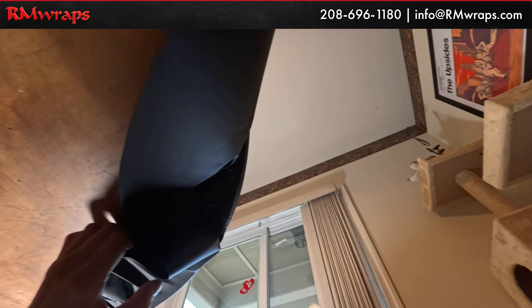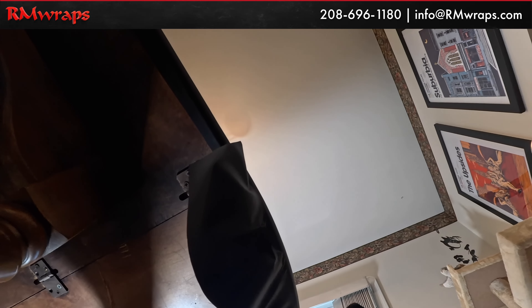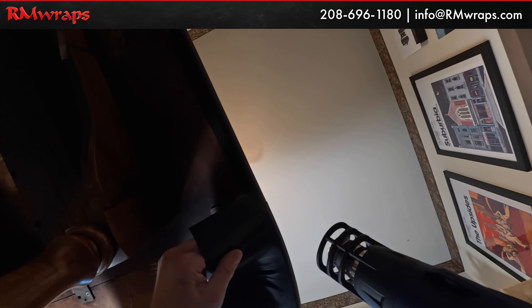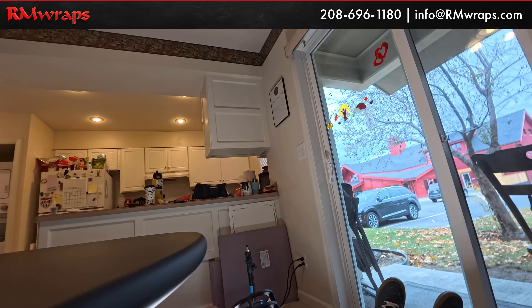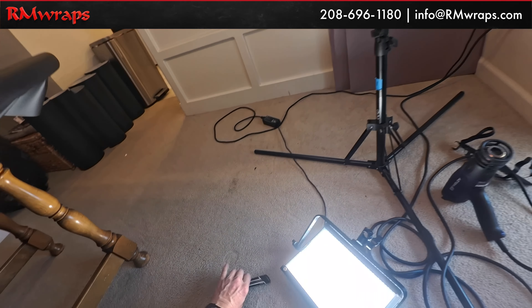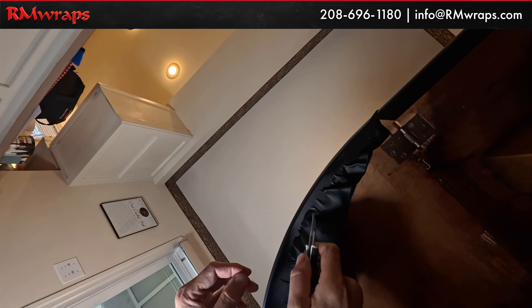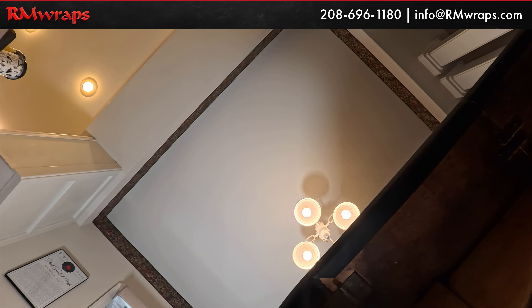The good thing about using this kind of vinyl - I told my daughter - if this starts getting damaged or you want to change the look, you just pull it off and reinstall another pattern, design, or color. That's the beauty of this. You can update it once a year if you want. That's the beauty of architectural films - custom prints too. Now I'm going to use my thumb as a spacer guide for about a half-inch bleed. It takes practice, but locking your thumb at a certain size gives you a consistent cut.